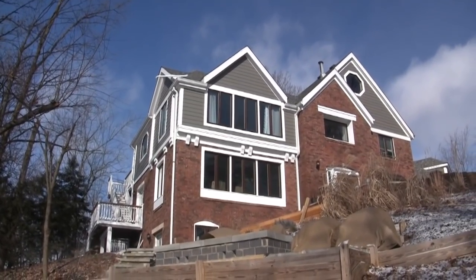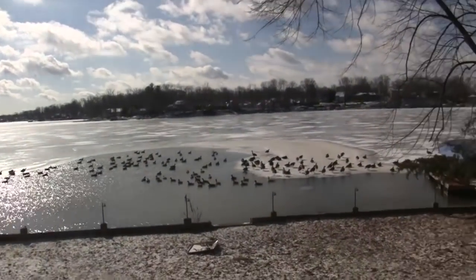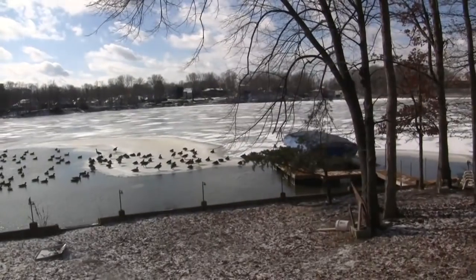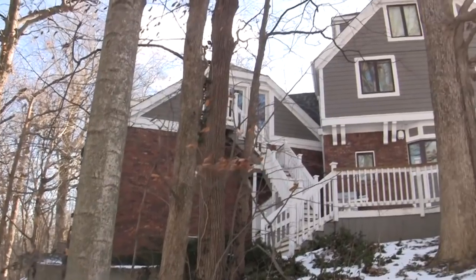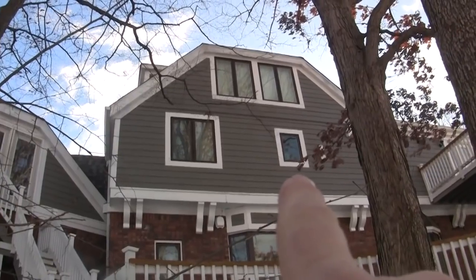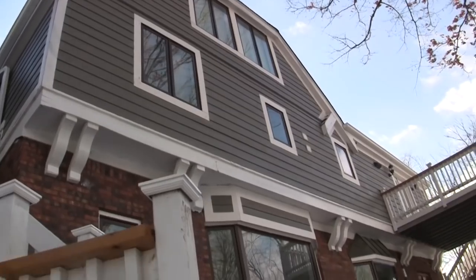This is the lake house we're currently renovating. You can see the entire lake is frozen except for this part where we have our dock de-icer — the geese are very happy about that. This is the back of the house, and it has a design flaw. There's an overhang where the house bumps out a couple of feet, and that little window is a bathroom whose drain is very close to the exterior wall — that's why we're concerned about it freezing tonight.